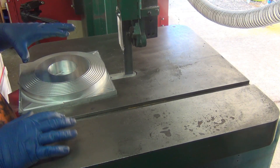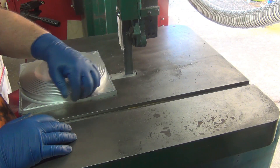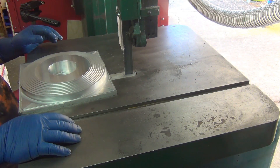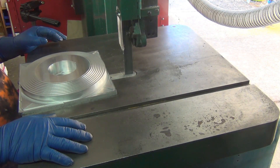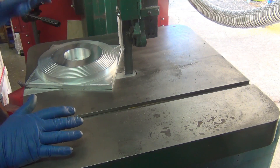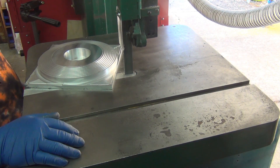There's still quite a bit of excess on here. I'm going to cut these ears down to make it a little easier to turn on the lathe — that way I can get them rounded off. I probably could have done the whole thing on the manual lathe and then just put it in the mill for the last step. But considering how much it cost me breaking end mills, I probably should have. That plastic stuff is a nightmare. Not sure how much more I'm going to cut on here.